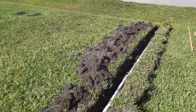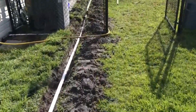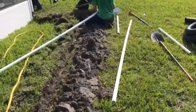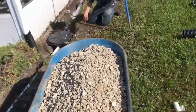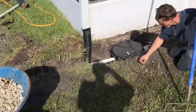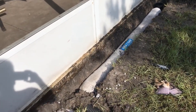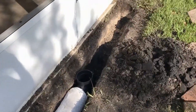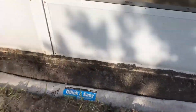Our discharge trench is excavated and the line is just laying down there right now. We're going to hook our couplings up and glue all that together. Back here everything's coming together real well — Chuck's plumbing the discharge. Remember you have to glue each fitting — real important. You can see our sump pump installed; we've hooked up the downspout as well. Then we've got the easy flow quick drain, and we're adding gravel to bring it to grade so the water drops right through the system. We added a catch basin to pick up this low spot of water, and another one by the door. We'll put the pavers back, gravel that section, cover it up, and we're done.